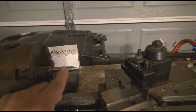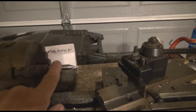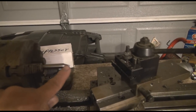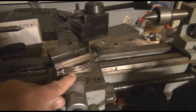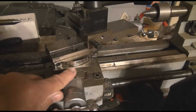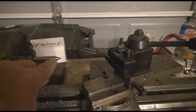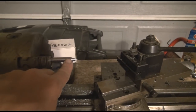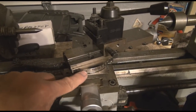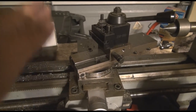Of course, this is level, and a 90 degree would be a flush cut, so it'd be flat on this side. What we have to do is take 90 and subtract what we're going to do on our angle down here. In this case, it's 20, and 20 degrees here is going to give us a 70 degree from the point all the way out. We're going to modify that and make it a 60 degree, so we're going to have to put this on 30, because 30 and 60 is 90, and we're subtracting that off of a full face cut.